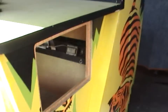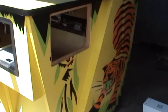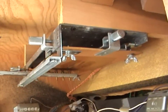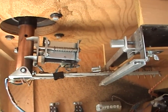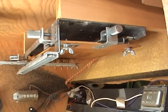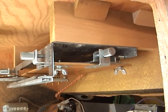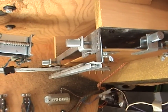Coming along to the side of the game, there's a little access door where you can actually get in and see the gun stylus a bit better, and you can actually perform an alignment. If the game's been moved or transported it may shift, or just through wear, so you may periodically need to align and adjust it.